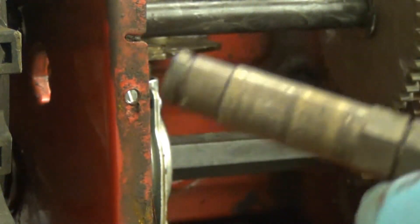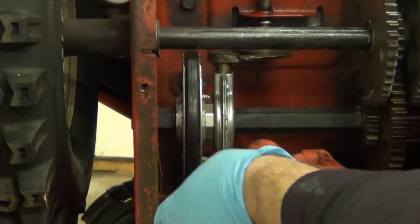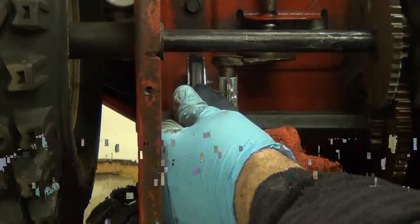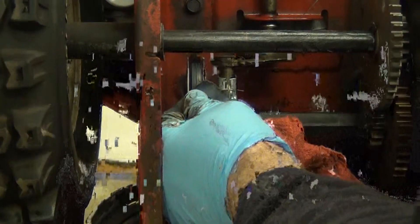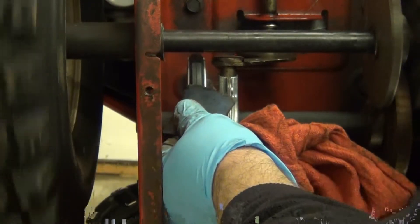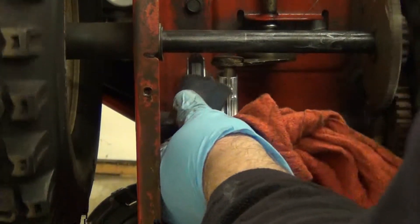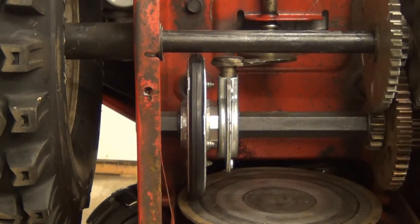That's a shot of the old speed shaft with the damage from the bearings. I'm just giving the friction disc a little buffing — I use a little bit of sandpaper on it just to take that center piece off and soften the disc up so it grabs a little bit better. I usually run them on the belt grinder for a second, but I forgot this one. Thanks for watching — leave feedback if you have any, I appreciate it.